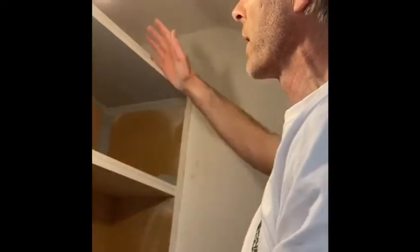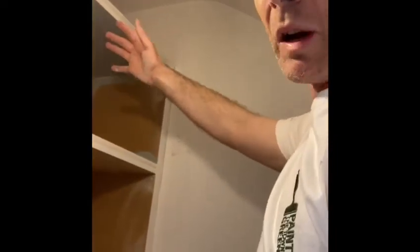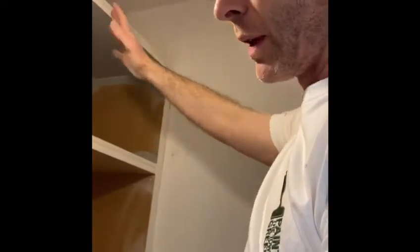So at the top I'm working my way down so I can put the bucket down here and I'm not damaging or smudging any paint I've done. If you start at the bottom and work up, you'll have an absolute nightmare. So always, whatever you're doing with painting generally, try and work with gravity — start at the highest point and work your way down and you'll find you have a much easier day.